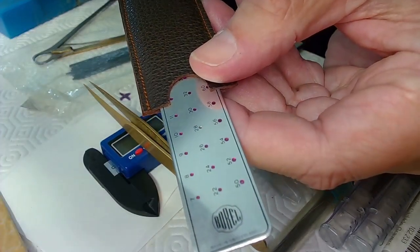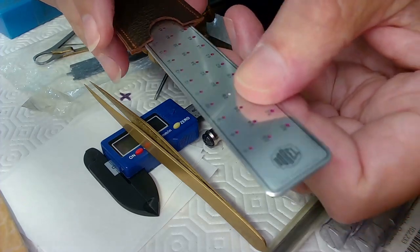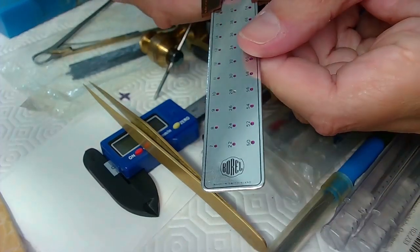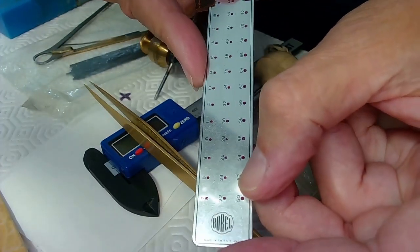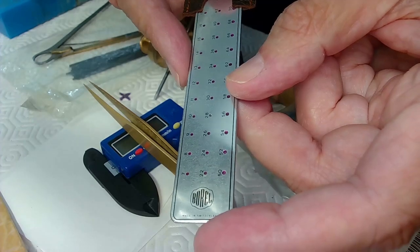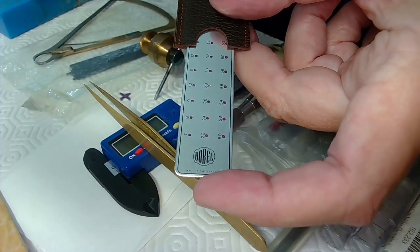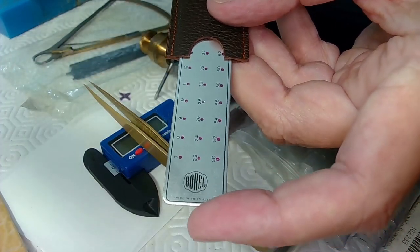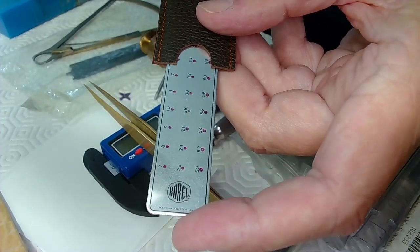The last thing you're going to need is a jewel gauge — I'm missing one of my jewels so I'll have to replace that, but this is a barrel jewel gauge and these are priceless. When you get close to completing the pivot on the balance staff, these are the gauges you use. You'll probably start measuring when your pivot is around 0.22mm, and if you're really good you can get your pivot down to 0.17 or 0.18, then work your way down to 0.11 or 0.12 or whatever size you need. You'll need to measure the jewel hole on the upper and lower balance staff jewels, because in this watch the pivots aren't there so I can't assume I know the pivot size.